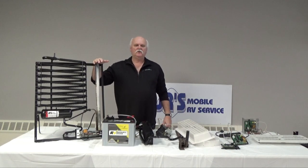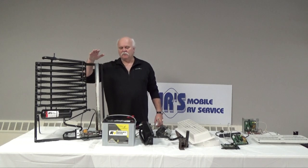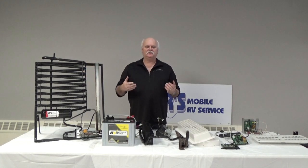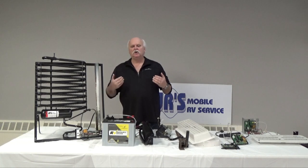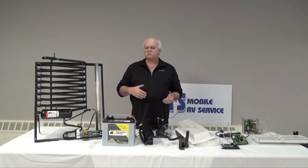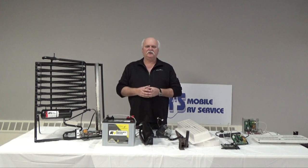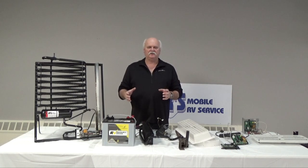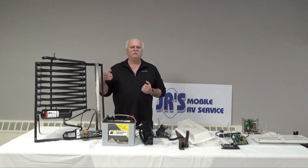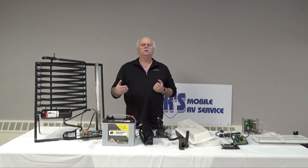Refrigerator, when you're getting ready to go camping, it's best to try and get it started the night before with nothing in it. They're most efficient when you pre-start them or get them already ready to be cooled before you load everything in it. If you were to load everything in your fridge, then turn it on, it'll take probably at least overnight for it to get back down to cool, because it's got to take all the humidity and everything out of all of our food and our ingredients that we put into the refrigerator. So it's always best to start them before you get ready to go out on your trip, and before you load them before you go on your trip.